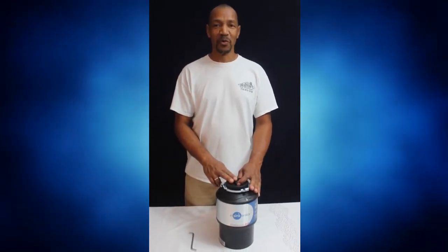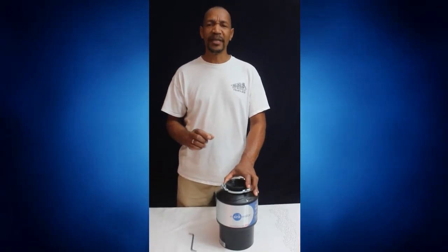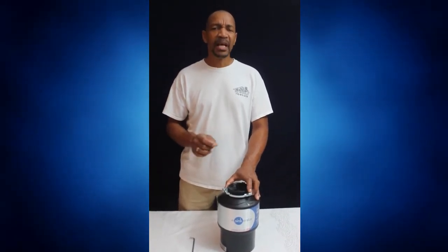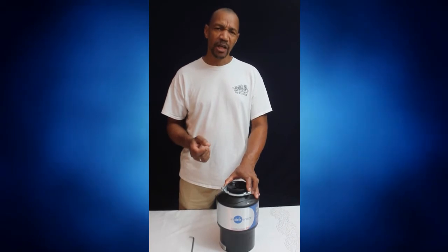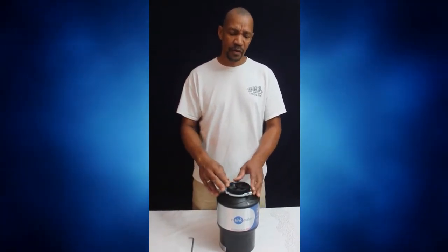Number 2, how do you unclog a garbage disposal? When your garbage disposal clogs, most of the time you hear a humming noise, like the garbage disposal is stuck. What you want to do is cut your power off, make sure your power is off.